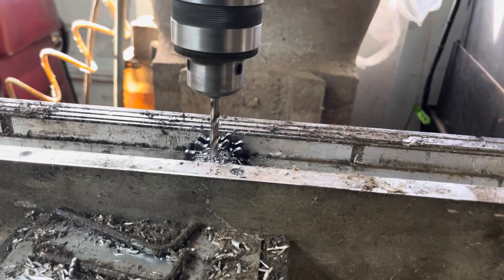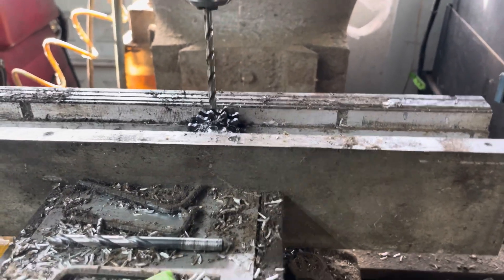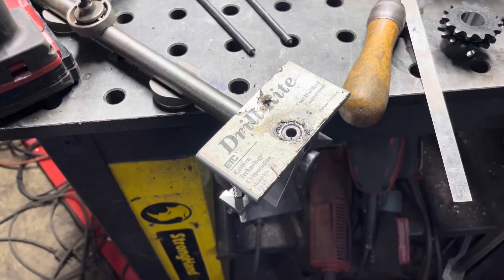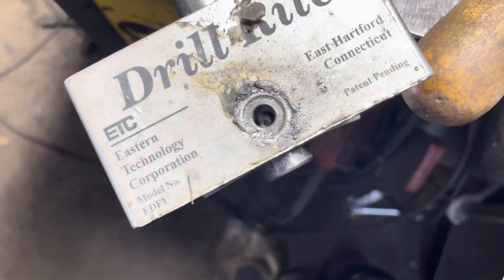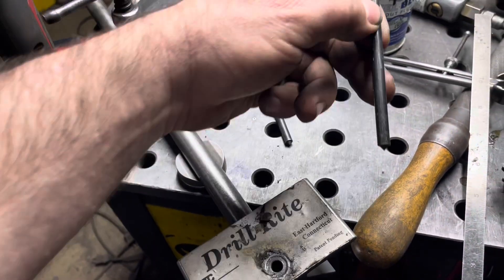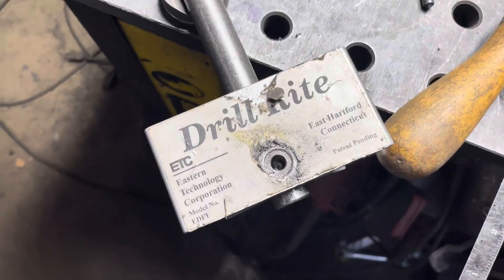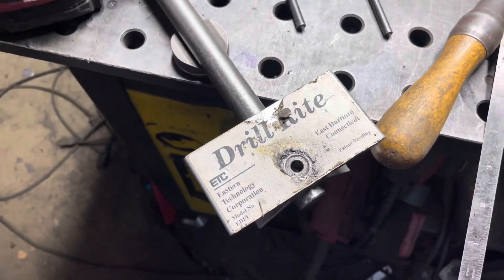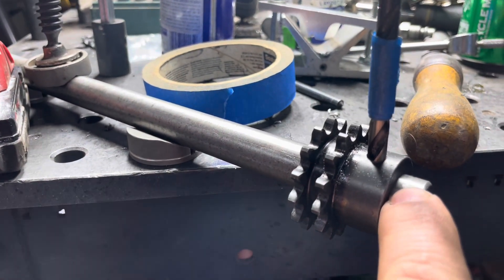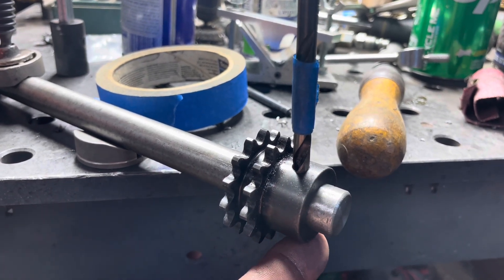There we're through the first portion. Now that I'm through, I'll do a second drilling operation with the clearance for one half of it. For the steering shaft side, we put the gear on at the right spacing, center punched it, and now we're using a drill-right fixture. We used a punch, aligned it, and we're going to drill that out so we can mount the gear. I've centered the drill bit onto the pilot we made with the quarter-inch drill bit, and I've marked five-eighths up so we don't drill all the way through the shaft and damage the threads on the bottom side of the sprocket.